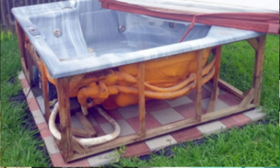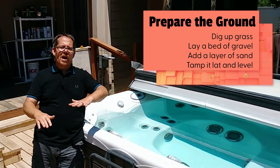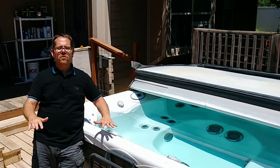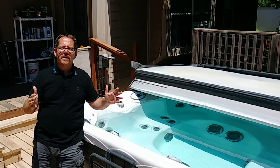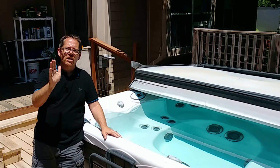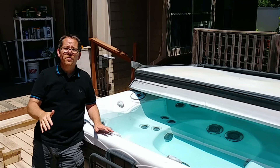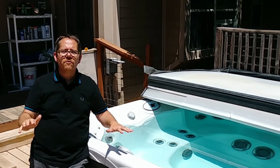You can put them right on the ground, but usually you just have to prepare the surface. Ideally, you'd dig up the grass, put down a layer of gravel and then a layer of sand, level it out, and put the paver stones down. But I've done it even cutting more corners than that, and it's very inexpensive compared to concrete. It's really, really important that you make sure the hot tub is level — specifically, the stones before you put the hot tub on it. You want that patio made of paver stones to be perfectly level.